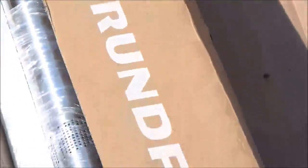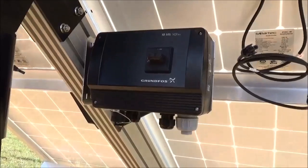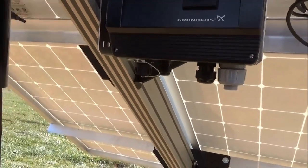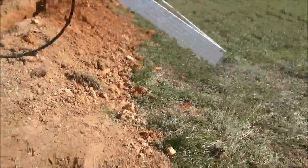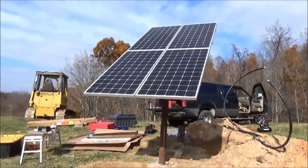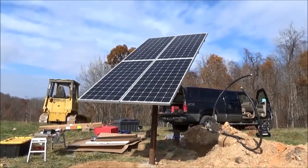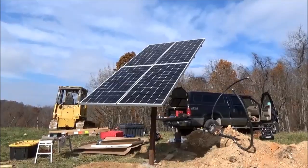We're rolling out our wire which is way down there. We're using the Grundfos IO 101 generator control - that's basically a little transfer switch. We'll have the pump wires, solar grounding, and a power cord for the generator, then a disconnect to turn all the solar power off and connect in between the two. It's a nice little four-panel series array. We'll pump water up 240 feet static plus 100 - about 350 feet total - doing 5.5 gallons a minute at 350 feet of elevation, pumping probably 1,200 feet away to some elevated tanks.